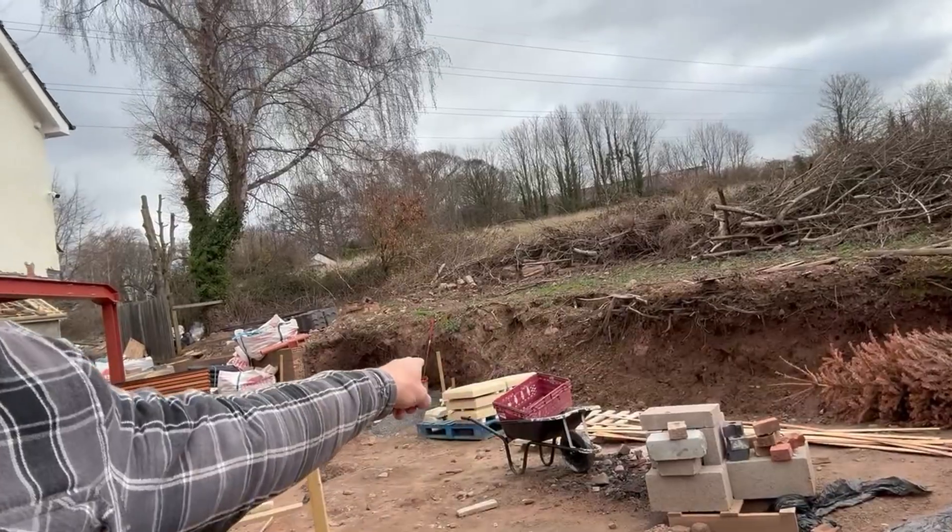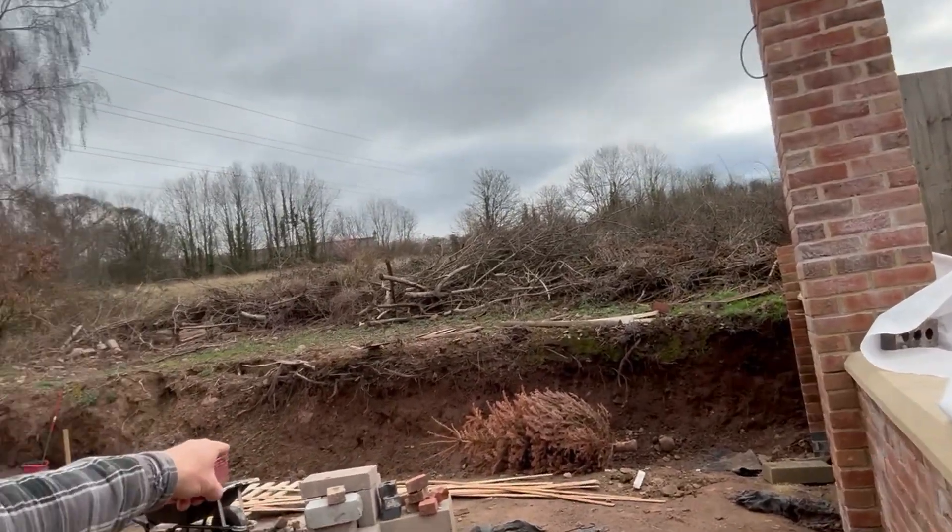All my gravel got delivered so now I've got a perforated pipe to go behind this wall. I need to calculate the fall that ends where this wall is going to go across as well. I want a one-in-80 fall, so to calculate that I need to find the overall run. My run is eventually going to be 21 meters because I'm finishing over in that corner.